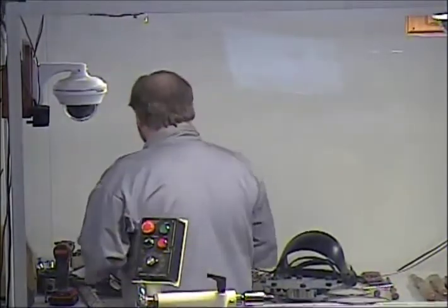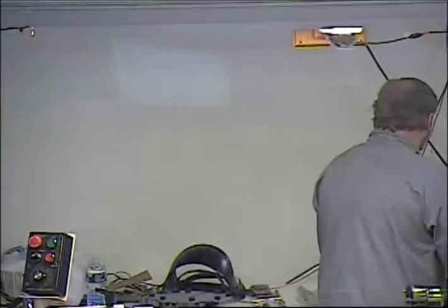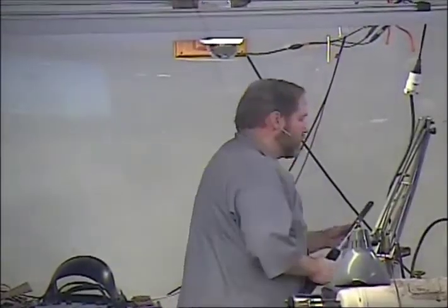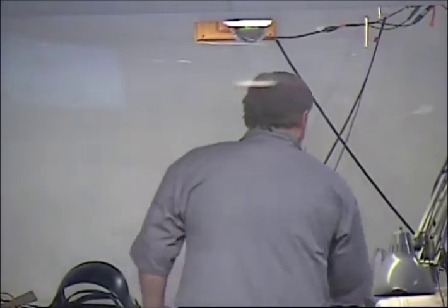All right? So, let's first talk about the 40-40 grind. The 40-40 grind is a specific grind of a tool that describes the top angle and the bevel, or the cutting angle, of the bowl gouge, both being at 40 degrees. And it's as simple as that. So how do we achieve this? By grinding it, of course.